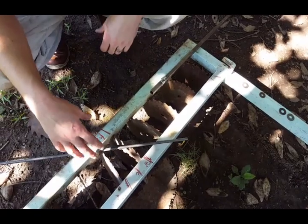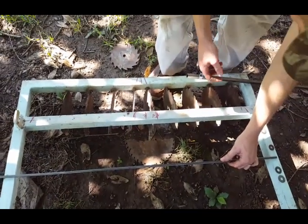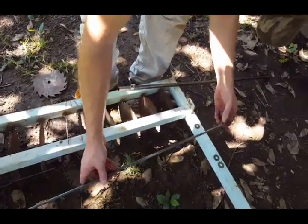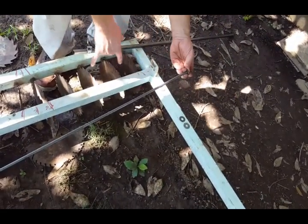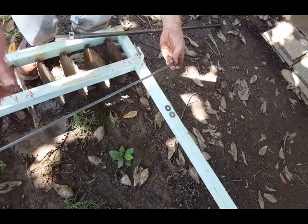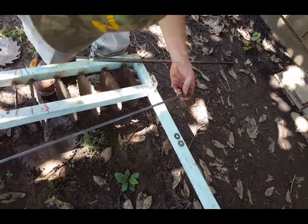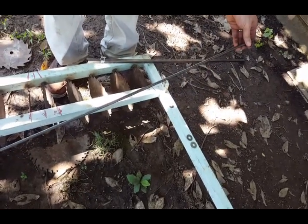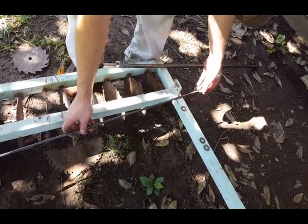Now, to hold the rod on, I'm going to have to devise a system. I think the easiest way is to just drill holes into this bunk bed frame. And on one end of this rod, I plan on welding this little washer on permanently. And then I'll slide the rod in, slide the 3 blade square tubing section on, then the central 4 blade section with the washer in between, then the last 3 blade section, and then slide the rod through to this other hole and just put some kind of keeper, like maybe thread the end of this rod and put a washer and a nut, a lock nut on there. Yeah, I think that's how we'll do it.